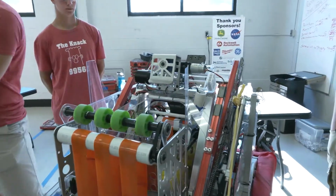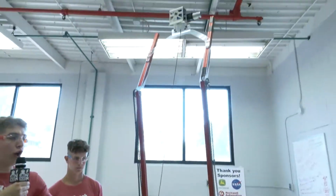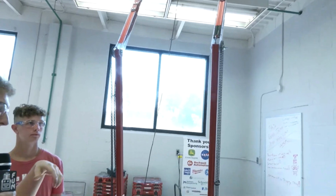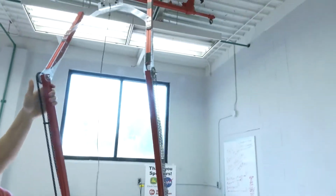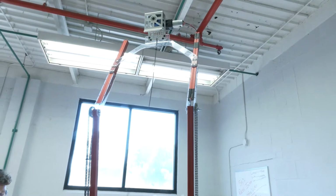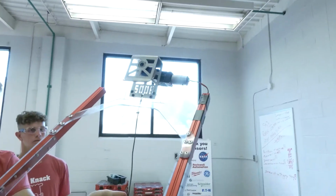So if we shoot the lifter up in the air, all of our load is pulled through this string, and the whole lifter has Lexan and polycarbonate integrated into it so that it's super flexible. The lifter can take a hit, get slammed into anything, and it's never going to pop apart or bend or torque apart. And then we just use our winch down here to pull in our hook, and the rest of the system just kind of falls down at the waist side.